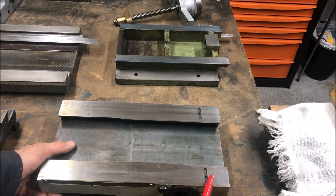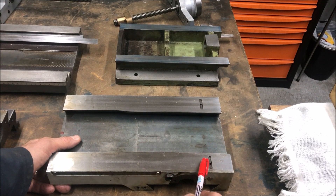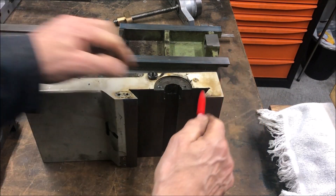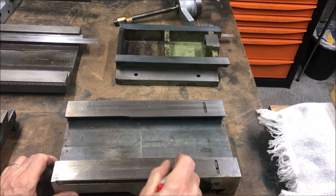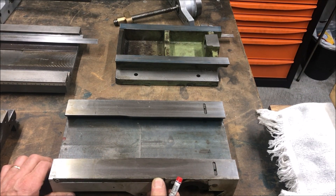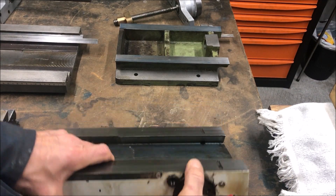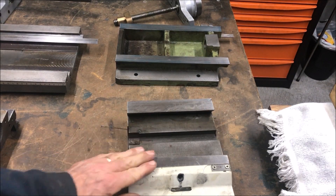One thing that is lacking on most of these Chinese machines I've seen is oil canals — oil lines. Actually, they are there, but the distribution on the ways is lacking. And here is also where we have learned that you should put the flaking or scraping not on top — that's just for eyewash, really. But if you put them on top so it's exposed, it's also exposed to dirt, and it's easier to get dirt in.